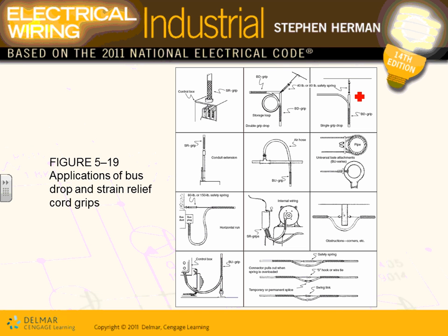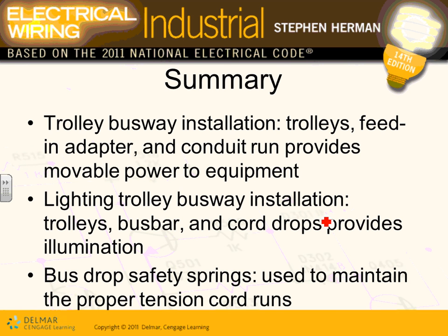All this direction. Application of bus drop and strain relief. Look how many ways you can put the strain relief, guys, for a receptacle, and there are so many ways of bringing these cables into the equipment that you want, and having your strain relief in different directions. So be aware, there's a lot of details in that one. So that's basically it in terms of, guys, plug-in busways or trolley busways. The advantage of trolley busways, for assembly lines, or if it's a lighting trolley busway, is that it allows you to physically, mechanically move all your lights to a different location without unplugging them. You just slide them along the track, and off it goes. So that's your plug-in busway.